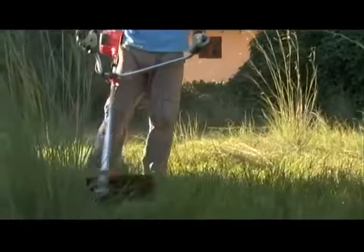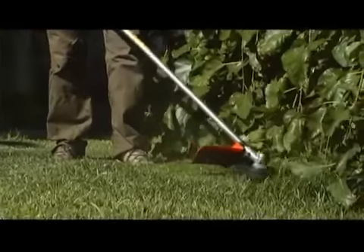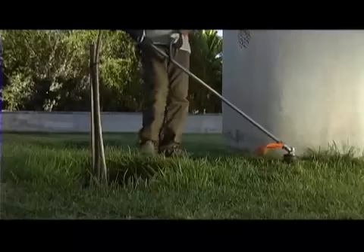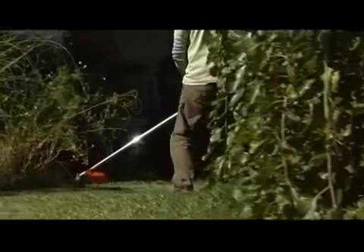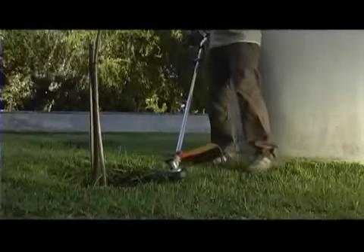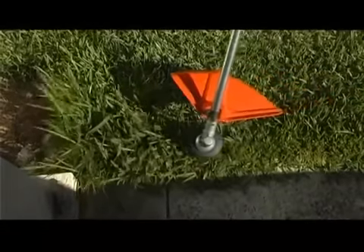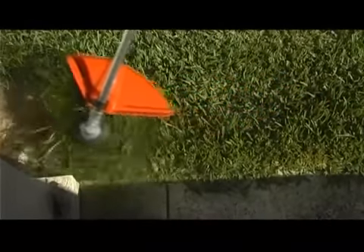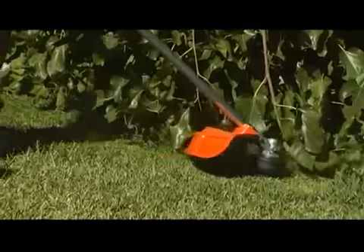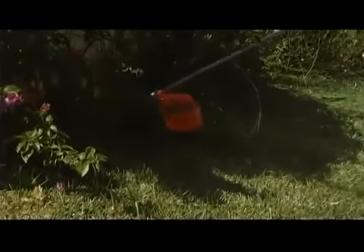A combination of quality engineering and ergonomic design make trimming and brush cutting tasks both enjoyable and efficient. The brush cutter will remove grass and weeds at the edge of your lawn and in other places your lawn mower cannot reach, such as against walls, fences, trees, and borders. To get the best results, hold the trimmer head at an angle just above the ground. More cord is fed when the trimmer head and its blue knob is bumped or pushed into the ground during full throttle. There is a knife on the cutting equipment guard that adjusts the line to the appropriate length if too much cord is fed. It is the end of the line that does the work. For efficient grass cutting, the cord length should be close to the maximum length, and you also need a high rotational speed on the trimmer head.